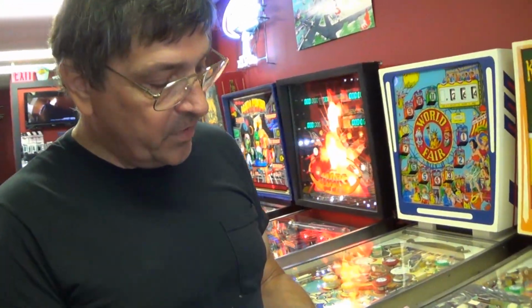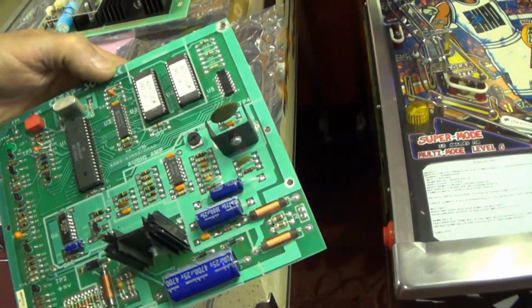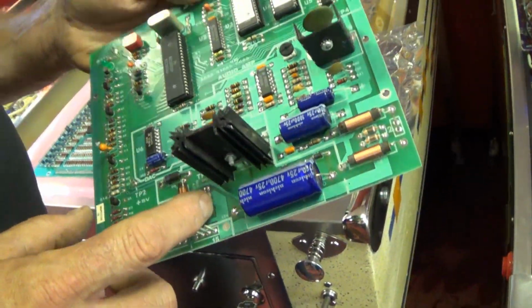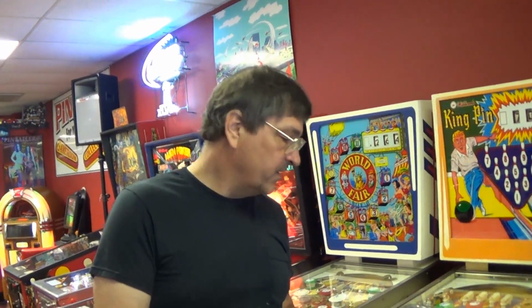And then the sound card, the usual: a new 1K sound pot. Okay, we knew there was an issue there. All the caps have been done, and this little C10 goes bad on these cheap ones. Remember the one that burned up on Black Pyramid? Yes, fire. There was a defective batch of these, because I talked to Jim, and he said he's run into a few. JT. So anyway, you replace that with a new one.